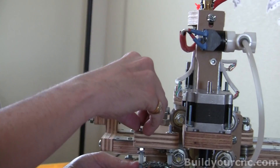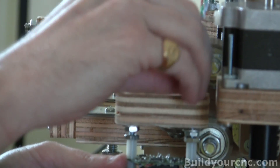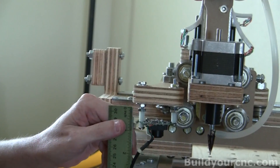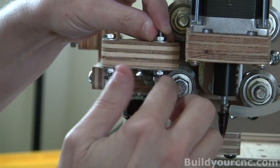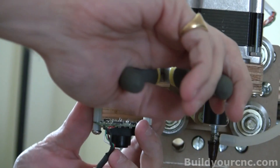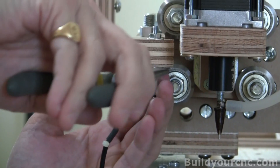I'll need two more nuts. Now we'll put the nuts on top, then do a little measurement to make sure this is horizontal — we want to get it as horizontal as possible. I'm going to use a printer ruler and make sure it's at the same level: just shy of two eighths from the one inch. Once it's all leveled, we can tighten the top nut. Finger tightness is fine for the lower one because you're going to tighten the top one down. It's really critical that this does not move at all, because if it starts moving your parts are going to be off.